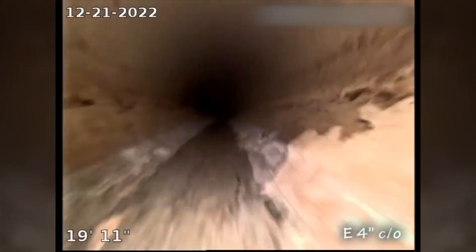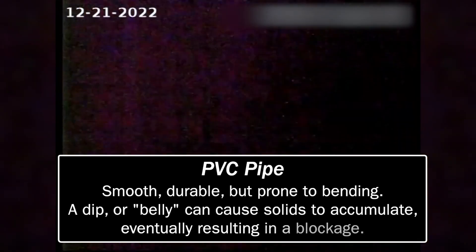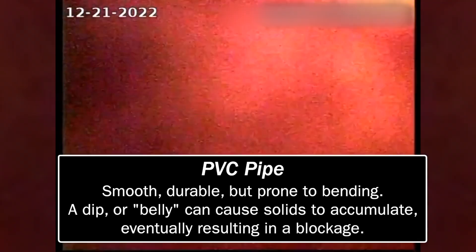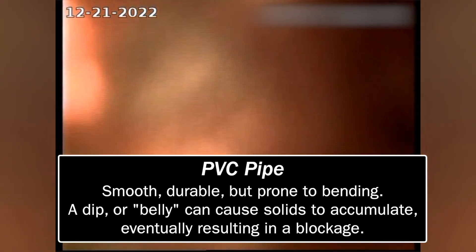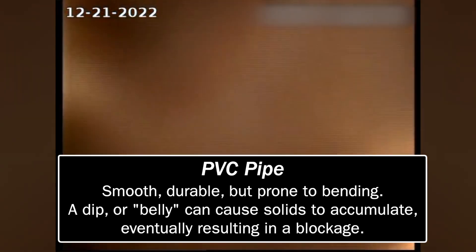We'll go down the line first because I'm going to find where this ties in. This side of the house has been re-piped, which is kind of nice. Looks like there may be a low spot over there that's holding trash. This has obviously been snaked because you can see how the snake has worn away the edge of the female adapter. There's a dip in the line.